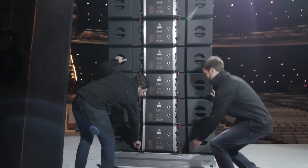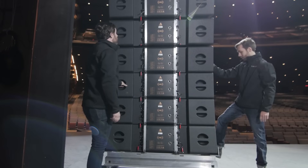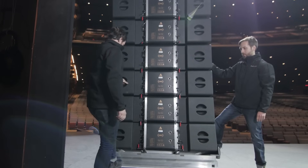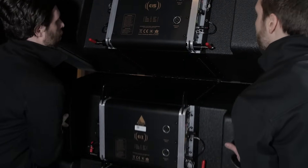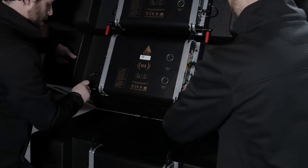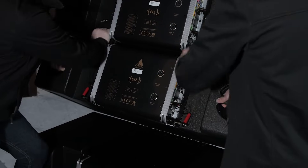The E-12 and E-15 rig without the need for any adapters — simply follow the same steps to connect E-12s in the same array. In situations where array curvature makes it difficult to rely on the auto-lock mechanism, disengaging the rear rigging one enclosure at a time to manually lift and connect the array may be necessary.